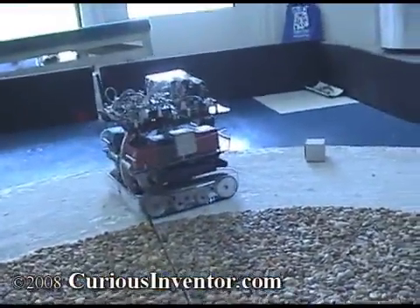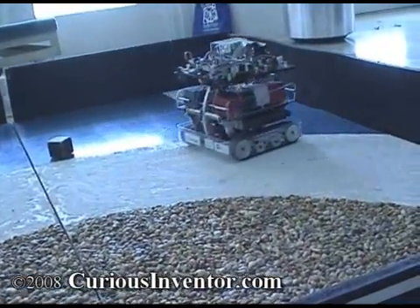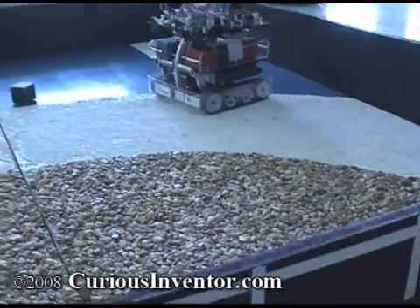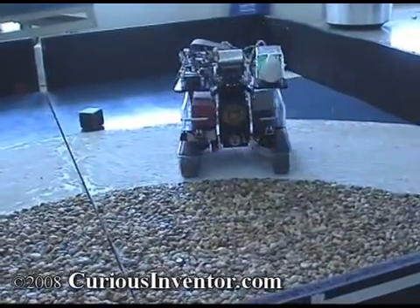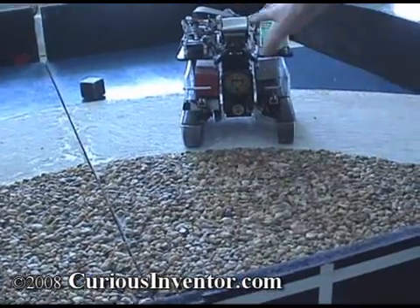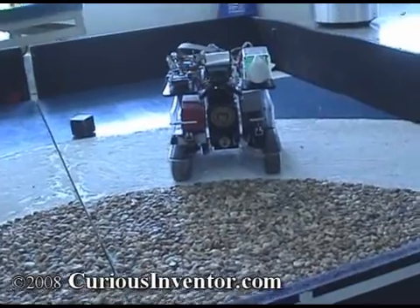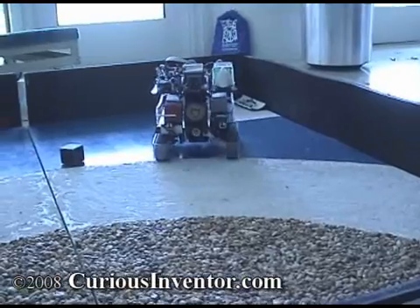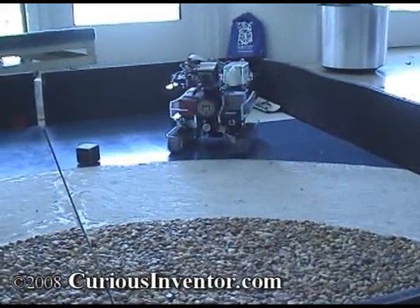The flash is there to read the scene — yeah, that's for the vision system. Is that to create a shadow, to identify if it's a block? Yeah, originally we were thinking we could use shadows to benefit the vision system, but if we wanted to do that we'd probably want to lower the flash so the camera gets a different perspective. How would you find a white block on a white surface? The camera uses an edge detection algorithm that's pretty good, and the flash does cast hard shadows.